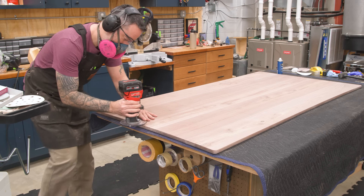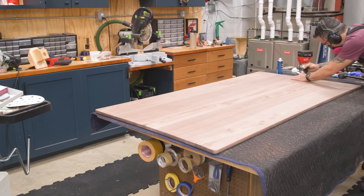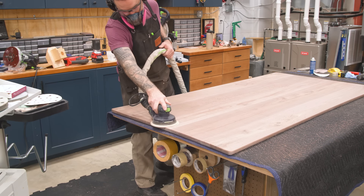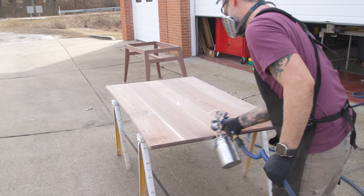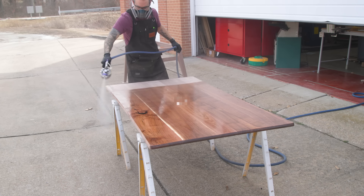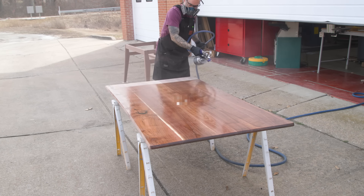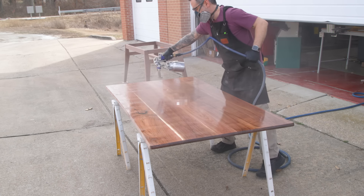The top gets a nice little edge round-over and a fingernail profile on the edges — it's subtle but adds a touch of class. Then a final sanding. For the finish, I'm using some catalyzed lacquer. The top and the base will receive about three coats. I don't spray lacquer much anymore, but it's hard to argue with the efficiency of the spraying process. On a warm day, you can easily apply three to four coats.